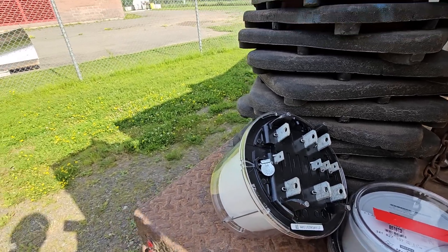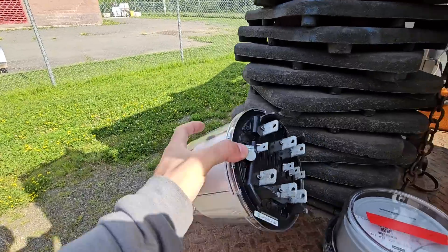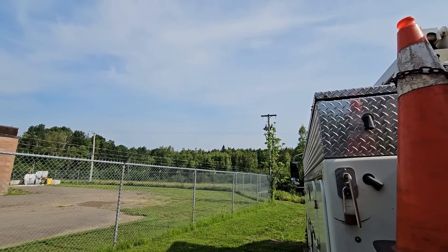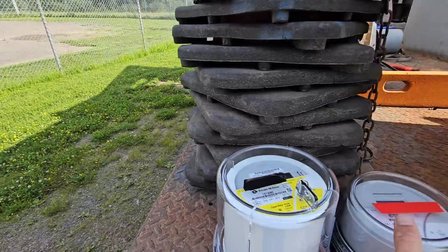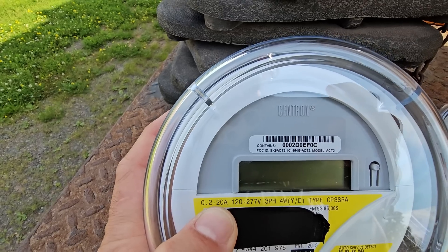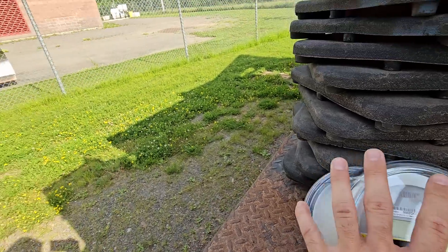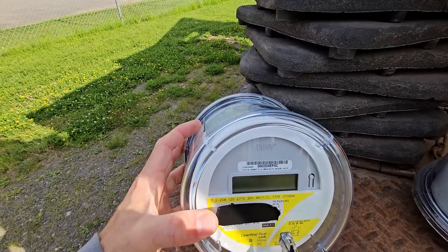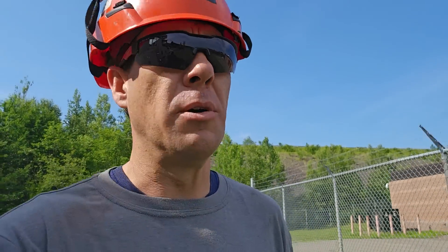A customer like this probably has a 600 or 800 amp service entrance. To measure that, we don't necessarily need a primary metering tank — most times there are CTs (current transformers) and PTs (potential transformers) inside the building itself. This meter here is rated for only 20 amps and up to 277 volts three-phase, meaning the voltage has been transformed down to 120 volts. If it were self-contained it could handle up to 347/600 volts, which would require a different meter.